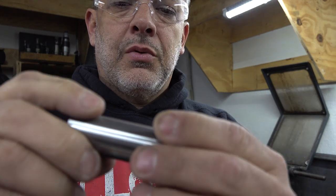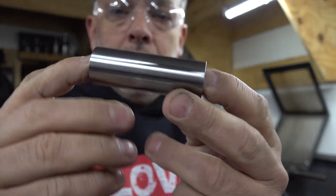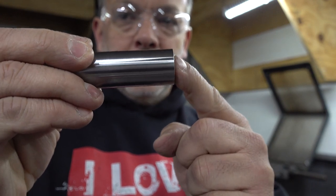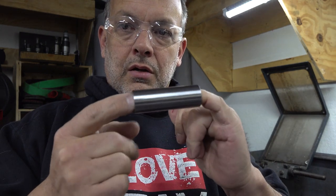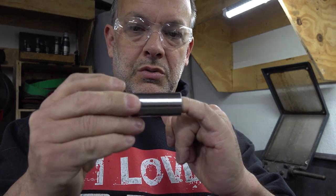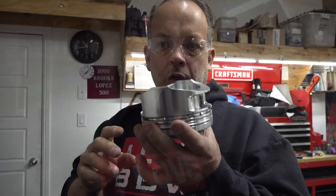The pin has a little bit of wobble in the chuck — this end wobbles a little bit. My lathe chuck probably isn't in the best shape, so we're going to put this on a granite surface plate and essentially roll it to see how straight it is, and go from there.